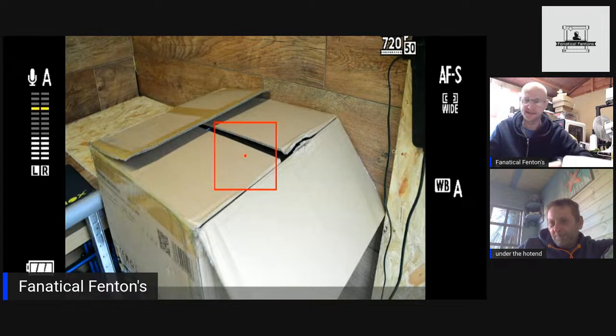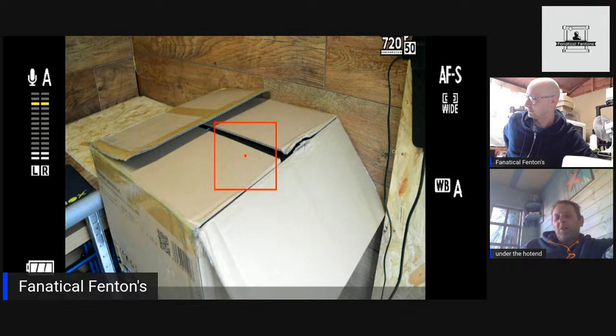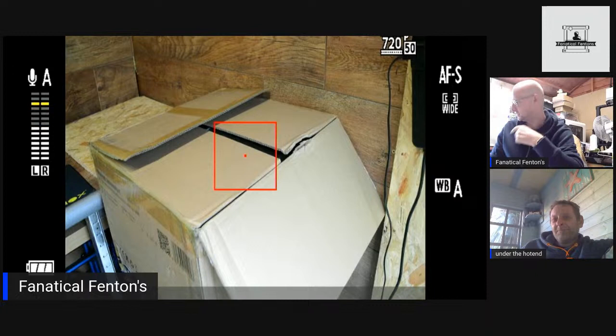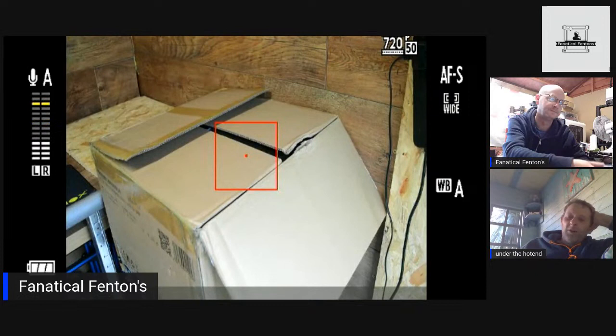I don't normally go over about 60 to be honest because I like a nice finish, but my CR10 Smart probably had about 100. Most of my prints are quite fine detail and finicky, so I'm generally around 45 mm/s, except on the Hornet where I crank up to around 65–70. Core XY can be a dream. On the website it says 80,000 hours of lifetime on the linear rails — that's pretty impressive.